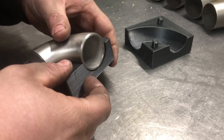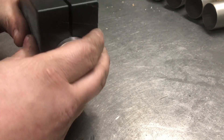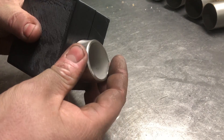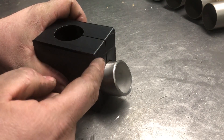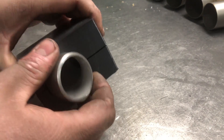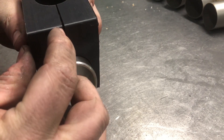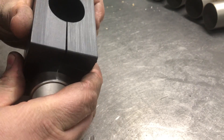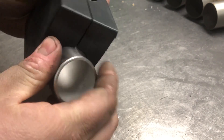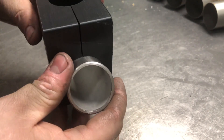How this works is: you have both halves here, you fit them together, you clamp this in your bandsaw at your desired angle, and then you use the edge here as your cutting guide for your blade — it's lined up against your blade so you've got your cut. It's got a little gap here so the plastic actually clamps up against the tube, rather than it just being loosely in there.